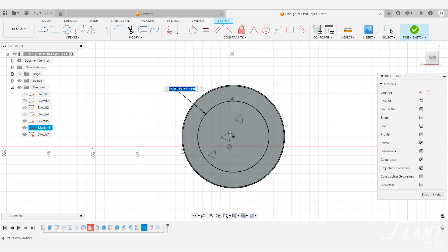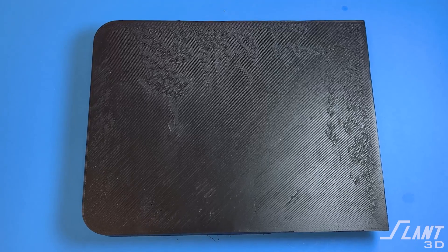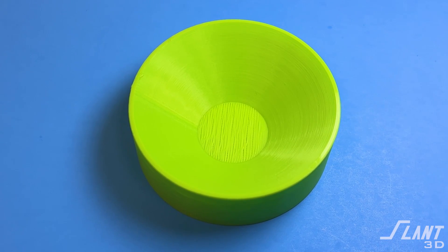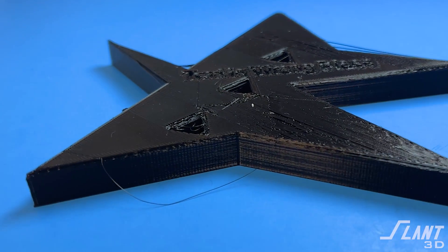You also eliminate the surface defect or the possibility of it occurring. Ideally, if you're doing something with an easy material like PLA, you can take it all the way down to one millimeter. Now the surface layer is stable, reliable, has no sharp corners, has no text, but has a good contact surface with the bed without a large contact surface that can be warped and deformed. This right here is the very perfect first layer, because it minimizes the amount of stuff that is out of your control, so you no longer have weird deformation from trying to keep text or other features tight and refined on the first layer.